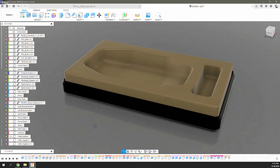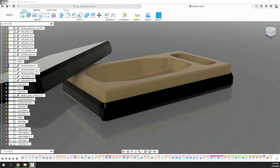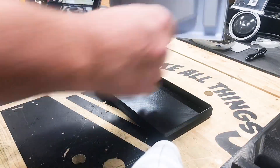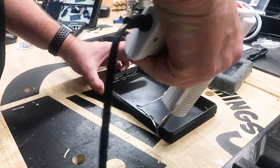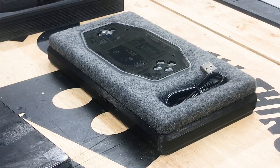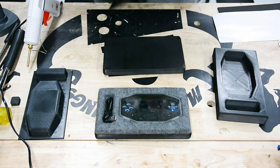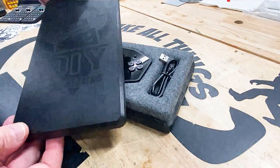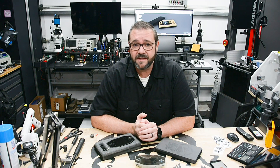To keep with the simple style, in Fusion 360 I designed a top and bottom case shell. These were also printed on the Lulzbot TAZ and didn't require any finishing. With all of the parts in hand it's time for fit and finish. First the Arcader holder gets hot melt glued into the bottom shell. Next to finish off the top shell I laser cut neoprene for the inside and black vinyl for the outside. Those are then applied to the top case. Finally I add a matte black channel logo to the top of the case and then slide it on for a smooth fit and finish.